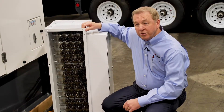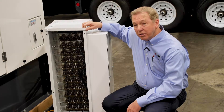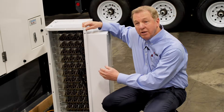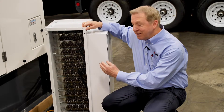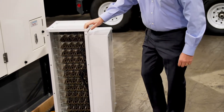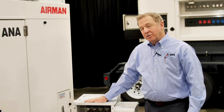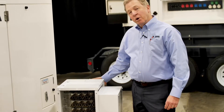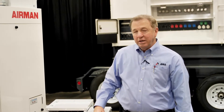This is a very durable system. Mica doesn't crack and break like ceramics. Also, these resistor coils have very low heat output. This is the same design being used in locomotives and mining haul trucks — it's designed to be on all the time if necessary, and it's rugged enough that if it can survive a mine site bumping down a mine road, it's truly going to last a lifetime on a generator. You can actually put your hand on the enclosure of the SmartLoad — it's warm to the touch but not hot. The heat is very manageable.